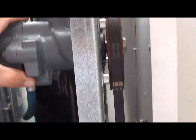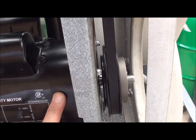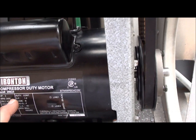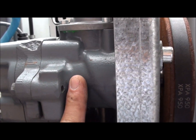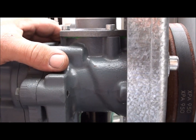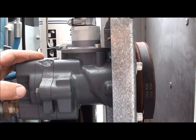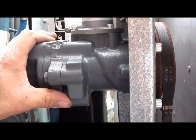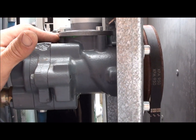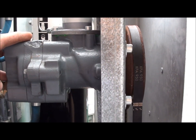Most of the better rotary screw compressors have the main drive shaft turning only at motor RPM, and that motor RPM is only 1,750. In this case we're at 3,600 RPM. I'm assuming we're driving off the male rotor, which makes it a bit easier — but if you drive off the female rotor, that changes the ratio and it goes even faster. That's just a way for some manufacturers to use the same air end for two different horsepower ranges. If you buy it at the small range, it's decent; at the high range with that same air end, it becomes a high-speed machine.